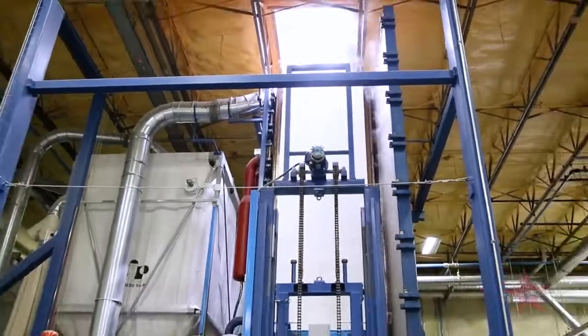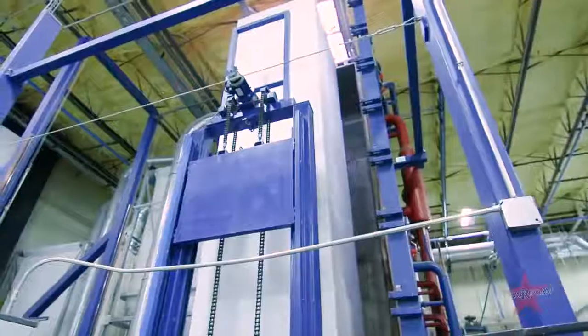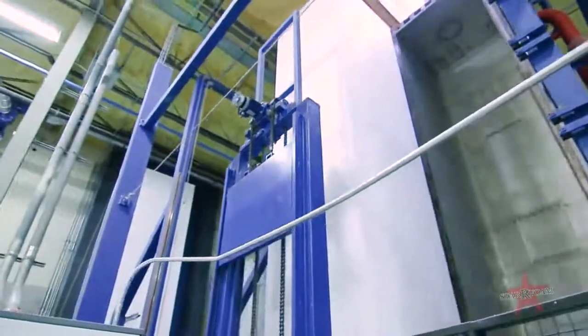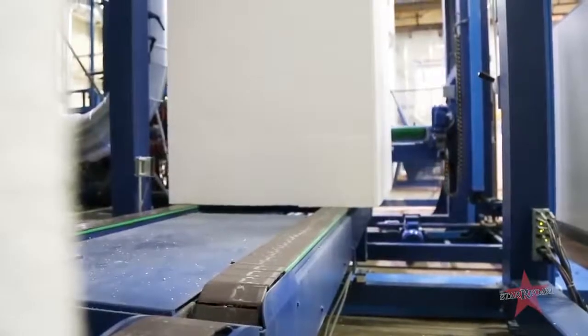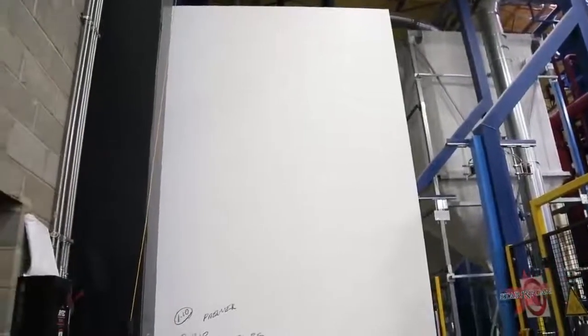As you can see, this is our block mold. We've just had a block come out of the mold and it looks great. Our mold is fully customizable in two dimensions — the height and the back door for thickness. From here, it's going to be cut and put into our off-gassing room to allow for the pentane and moisture to cure out of the block.